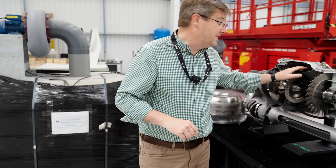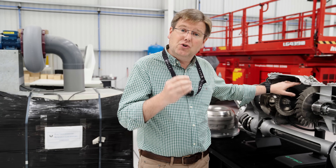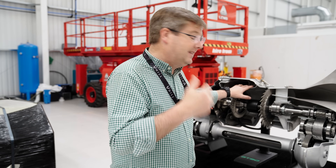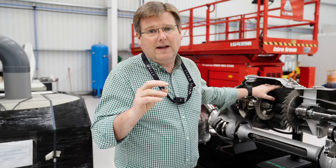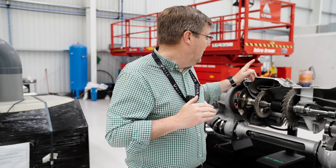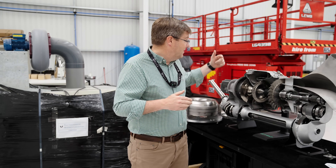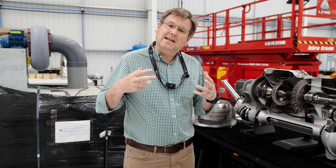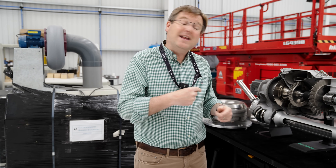In addition to that, the team has been working extensively on optimizing the spray nozzles. We've gone for a dual orifice design with a primary nozzle to give good atomization for starting and then a secondary nozzle to throw in the volume of fuel needed to generate higher powers. This is far more complicated than it sounds and has taken a lot of development. Within the next week or two we'll have all of that geometry defined and ready for prototyping, giving us the full range of operations the engine needs. To test that, we'll be extending our combustion test rig into a second generation system that will allow three combustion nozzles and a quarter of the combustion chamber to run across the full operating range of the engine, with far more instrumentation than we'd ever be able to fit on an operating engine.